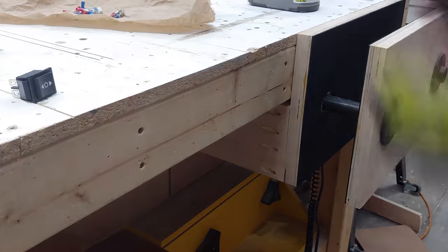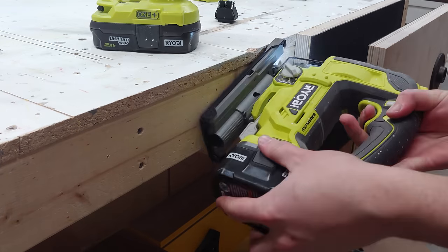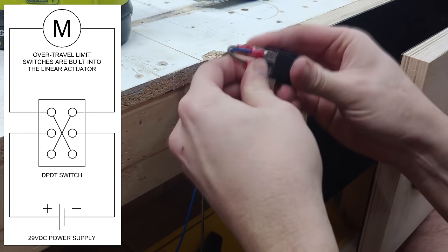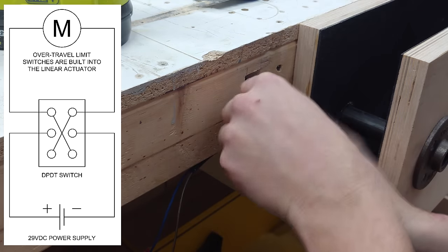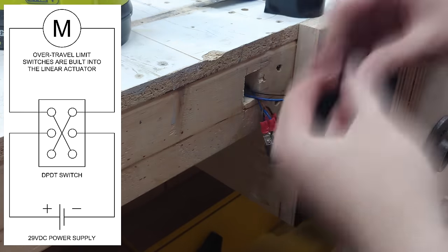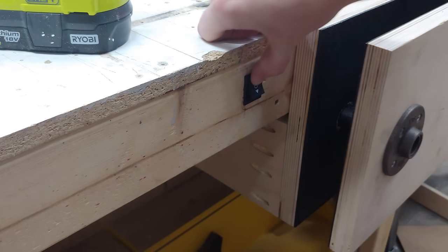With the vise now mounted I can go ahead and throw my attention to mounting the switch. I first drill a Forstner bit hole into the 2x4 on the front, as this is going to get flush mounted onto the front of my bench. I then use the jigsaw to carve out the exact rectangular shape while marking and taking measurements along the way. Now that the switch fits in the hole, I can go ahead and attach all of my wires. This starts with a crisscross pattern along the back of the double pole double throw switch, which is commonly used for forward and reversing. As this is not a huge motor load, we don't need to use a contactor and the switch itself should suffice. The power supply goes into the middle of the switch, and then we have that crisscross pattern for forward and reversing, as this is a simple motor that just requires the positive and negative to be flipped for forward and reverse. With the switch installed, we can see it working.